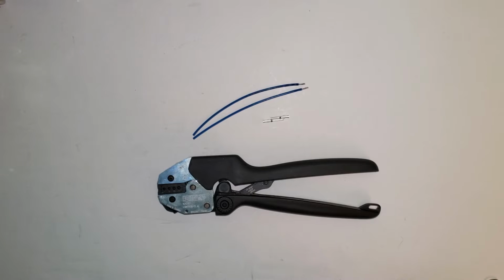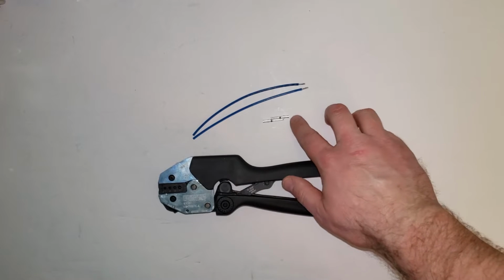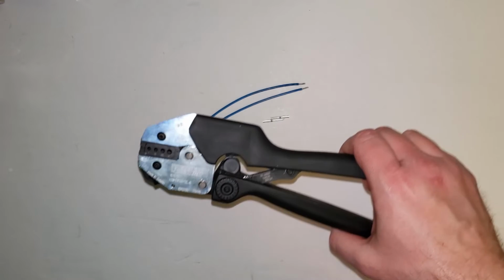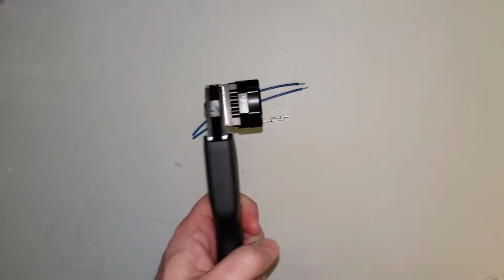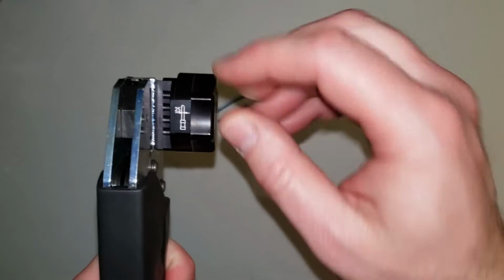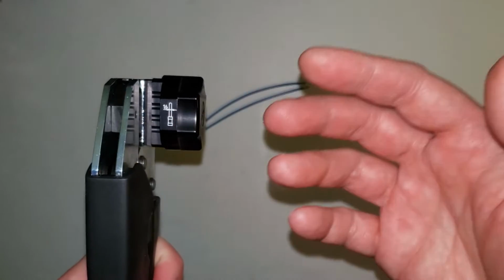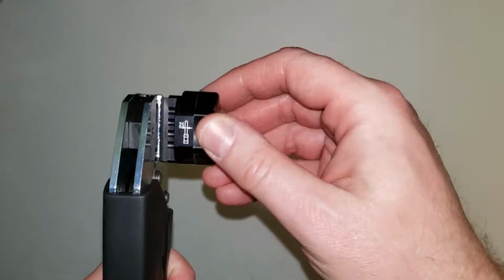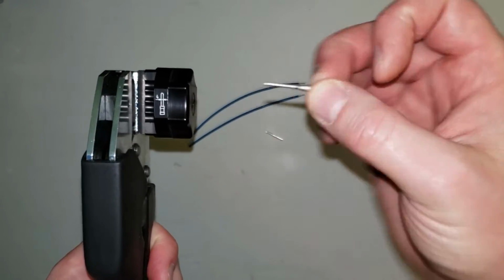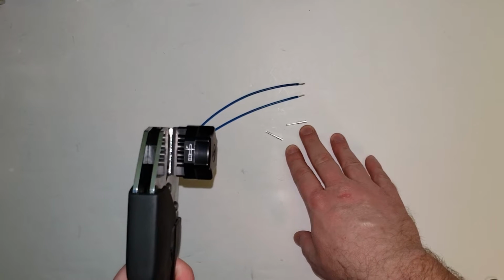So our next step here is to actually crimp the contacts onto the wires. Now, what I have here to do this with our contacts for HEAVYCON is a CRIMPFOX tool 1212-113. And this works with 3 different size contacts. You've got your CK 4.0, got your CK 2.5, and your CK 1.6. And that CK number, the 1.6 millimeters, 2.5 and 4.0, that refers to the diameter of the mating portion of the pin. So in this case, we're going to be doing CK 1.6 contacts.